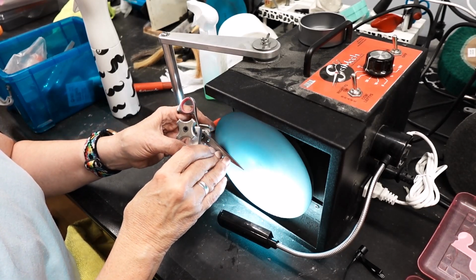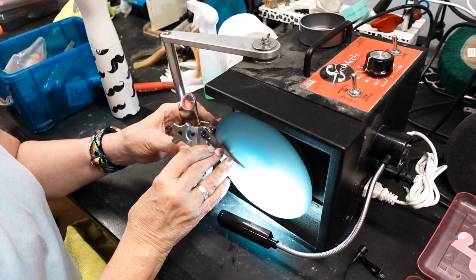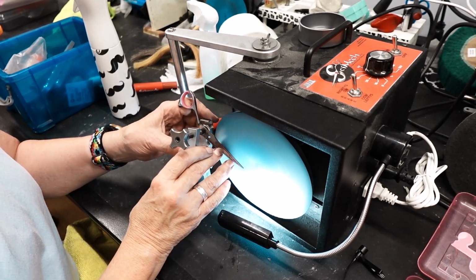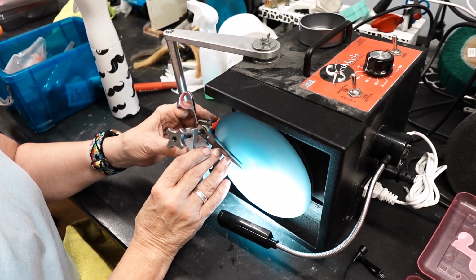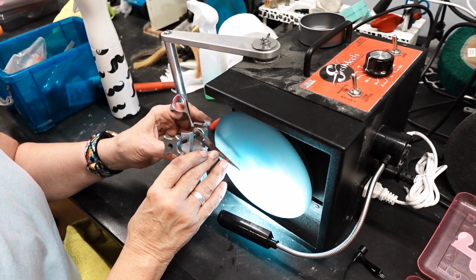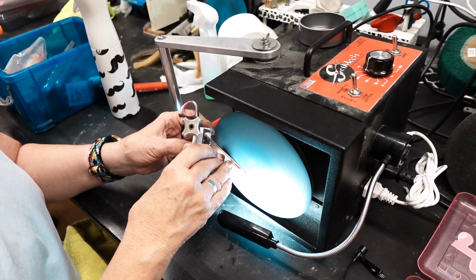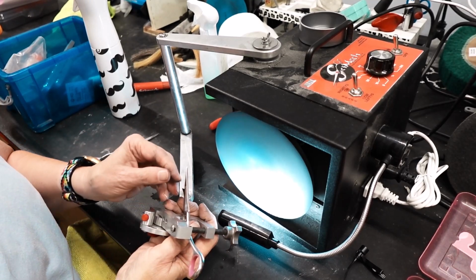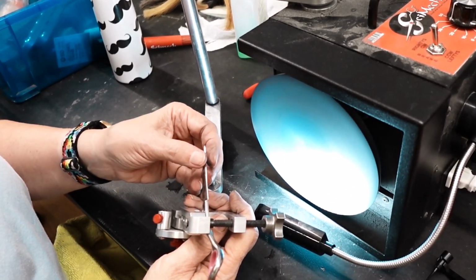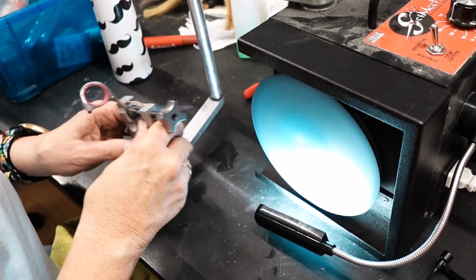And I'm trying to reconvex it as I go. That's why I'm pausing. You see me pause kind of here and then just take a minute at the edge. Usually when I'm training, I'm telling people roll in and then count to 3, but this time I'm trying to get that bevelly look off of it. I'm trying to make it look more convexy. So I got a burr all the way down.